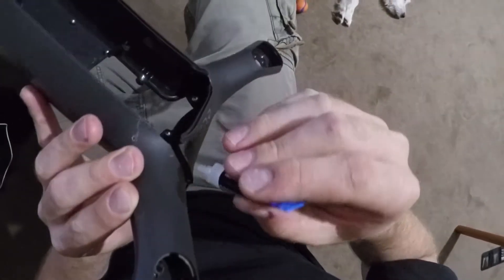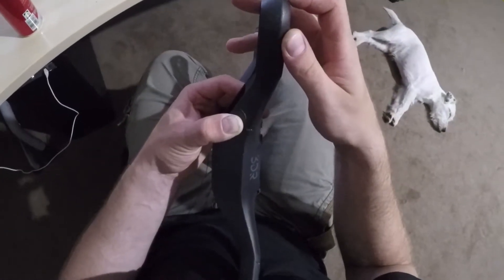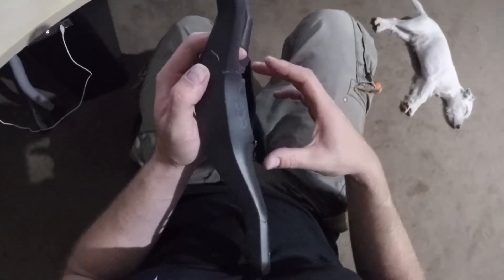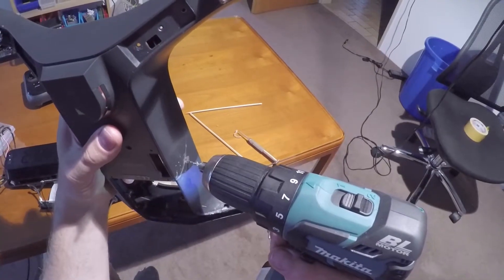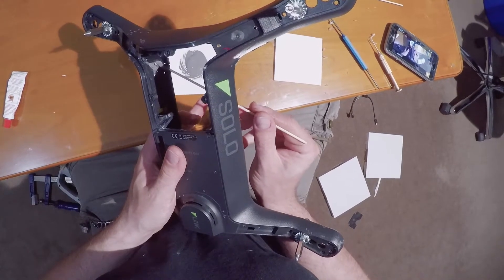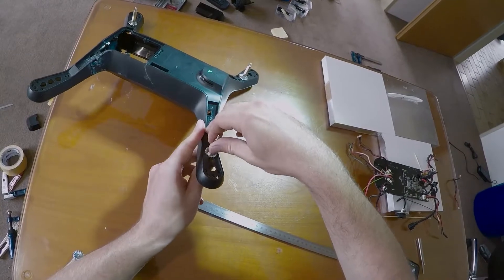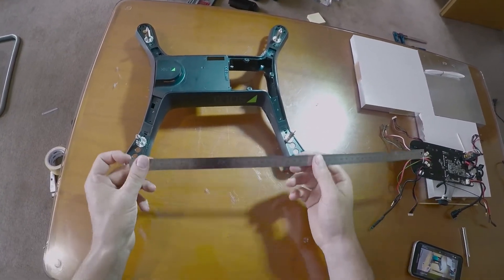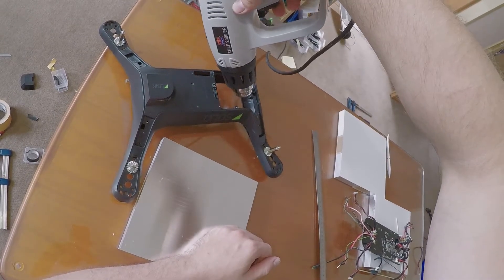All broken plastic parts are temporarily glued with superglue, which took a lot of patience because of residual stresses in the material. That's neither pretty nor strong, so I'll drill a couple of small holes around the cracks and cover the inside with JB Weld — that's at least strong, after 8 hours. I'll attach a couple of threaded standoffs to the motor mounts to have reliable reference points. That reveals that one of the arms is actually not co-planar with the other ones, and I think it'll be a problem in flight. I gently applied some hot air and that successfully got it back into position.